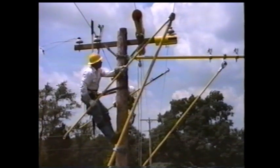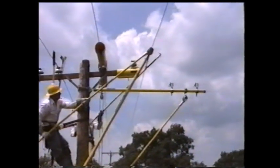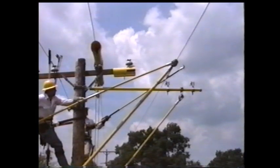After untying the conductor, have ground personnel pull on the fall line of the blocks that are rigged to the 2.5-inch by 14-foot wire tong. As they pull on the blocks, it will raise the conductor off the insulator.